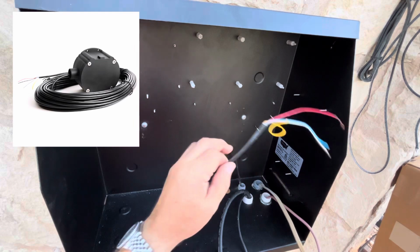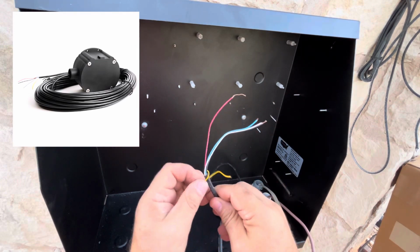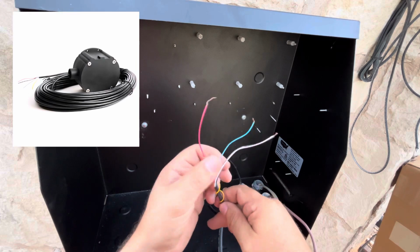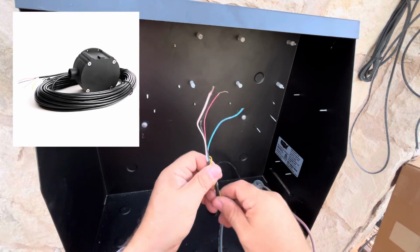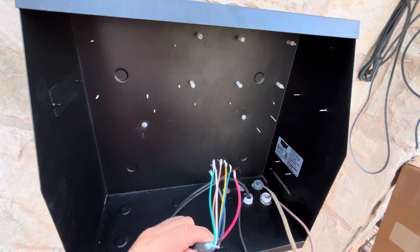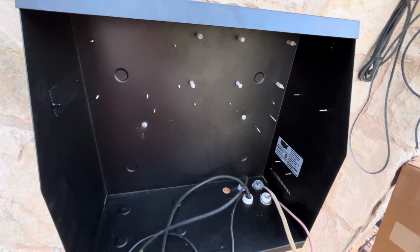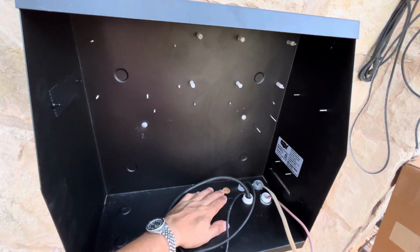Then we've got a free exit. This is a Cartel CP4 connection. So you're triggering off of this blue here. When it senses the metal going by, it'll open the gate, and then you got power, and then you've got 2 going to common, these 2 here. And then this is the far side actuator. We'll have to splice those wires to the plugs in here. This is just an extra cable that goes to the other side. We don't really use it for anything now. And then in that hole there will go the near side actuator. We'll go through there.